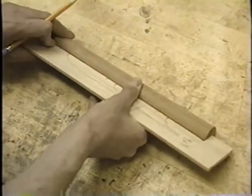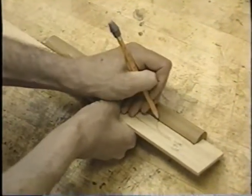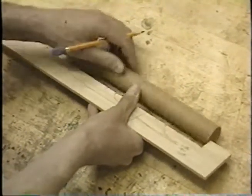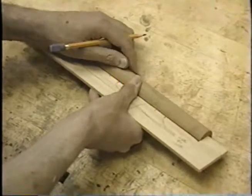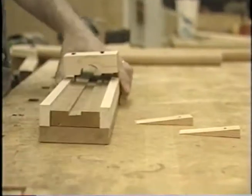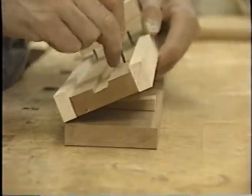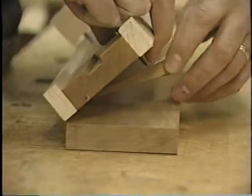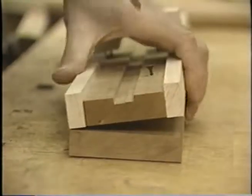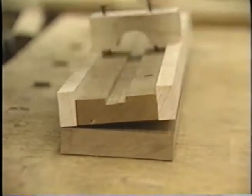Now, I mark up a real front leg post for drilling. My chair seat will be trapezoidal, not square. And I've designed it so that the front and side rung holes are angled 83 degrees to each other. These 7-degree hardwood wedges are all I need to make the difference. But the hinged top leaf of the jig can be set at practically any angle. I screw right through the wedge to lock everything into place.